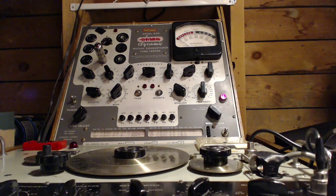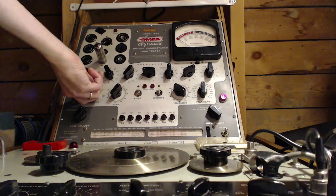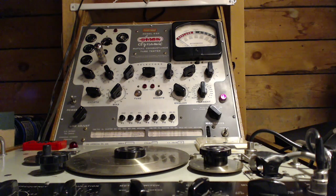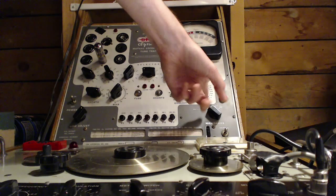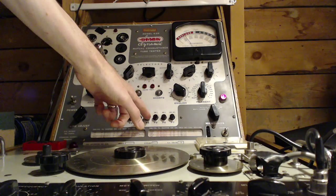I have the tube in the tester and the actual voltage — the B+ — is being applied to the tube. That is very different than the tester from the radio; the radio is going to put a much higher voltage on it. The triode section I'm doing first and it should come out above 630. So 630 is right here, and it is right on.